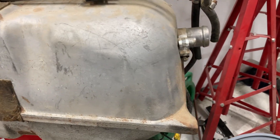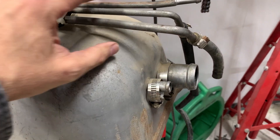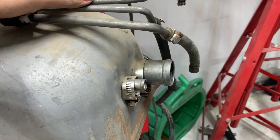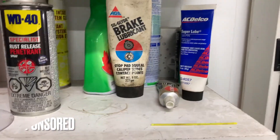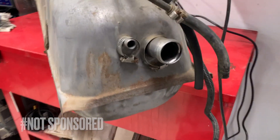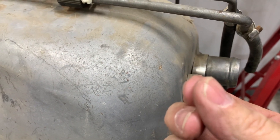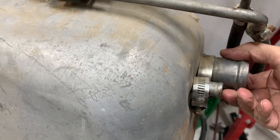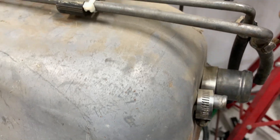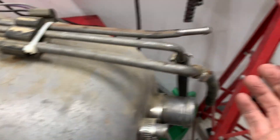Hey, just a little addendum here. When you put your tank back into your car, if you want to make your life a whole lot easier, go grab yourself a tube of Silglide — which everybody should have anyway before doing brakes, hashtag not sponsored. When you go to put the tank back in, just put a teeny little bit on your fingertips — we're talking half a drop kind of amount — and just smear it around all the ends. When you go to put them back in, those hoses will just go right on without a fight.